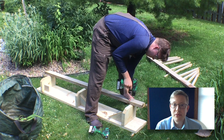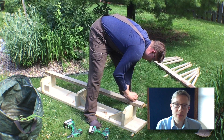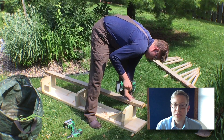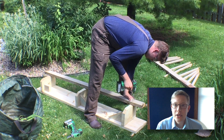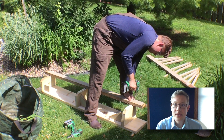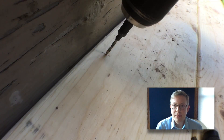Here are the stairs — they are very simple. Made them from some spare pieces of 2x12 and then two 2x6 boards. On the bottom, I'm putting on one of those 2x4s that used to be on the railing. That's going to be buried in the ground a little bit, but the rise is about seven and a half inches from the floor up to the deck. Here I am just clearing away the stones as that area gets prepped.